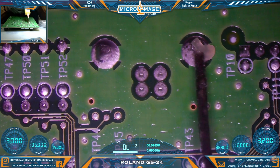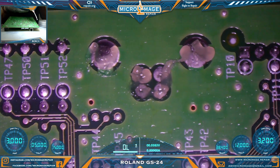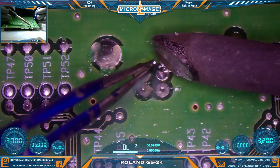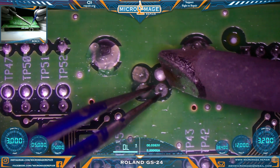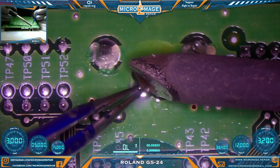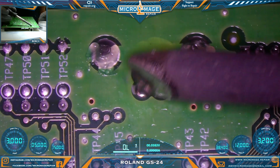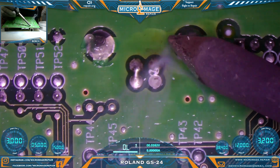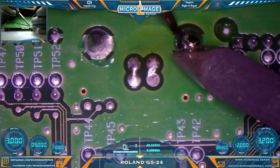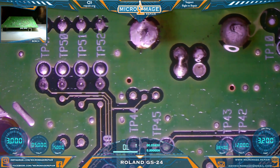Add some flux. All of our pins are still stuck in the board, which is better than ripping the pads off by a long shot. Grab some low melt. Let's start with these pins — we're just going to pull them out if we can. I'm going to try to feed in a little more low melt into those holes.